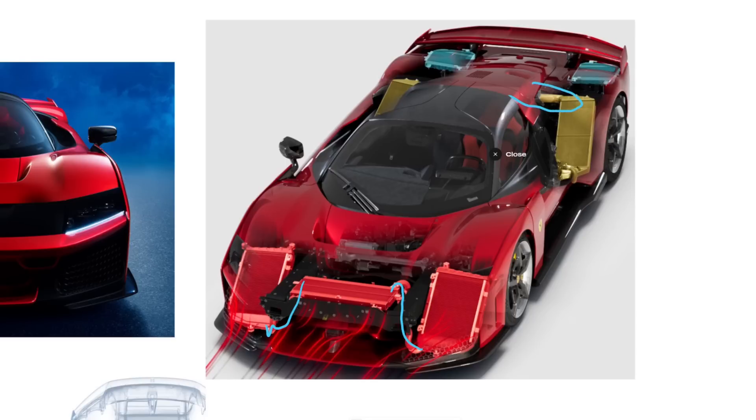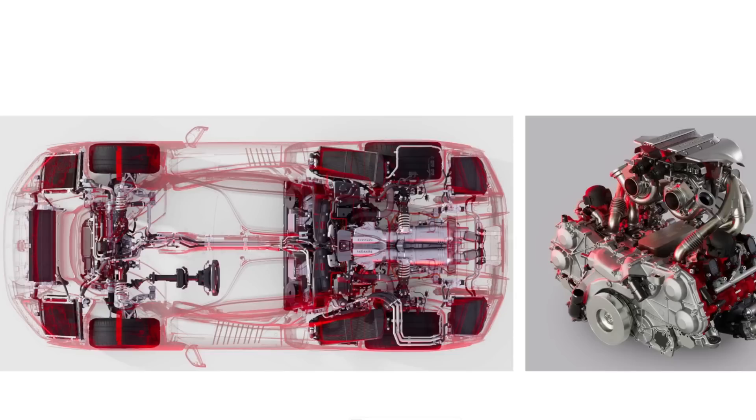The tube coming to the rear yellow coolers is quite large. To me it looks like these yellow coolers are the intercoolers for the engine — because it's a turbocharged engine — and then I think the main water cooling circuit is up the front. If you look at the top-down view, this supports my suspicion: there are pipes going into the top of the side coolers at the rear that look like the exit pipe of the turbo compressor, and then fairly large diameter cooling pipes run down through the center, out to the radiator and back.